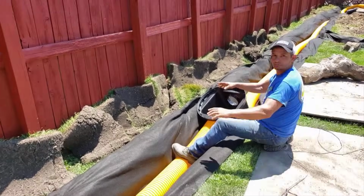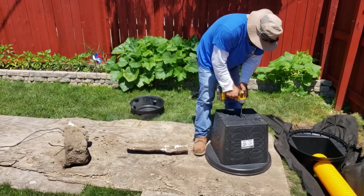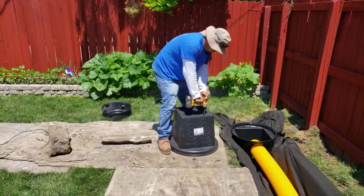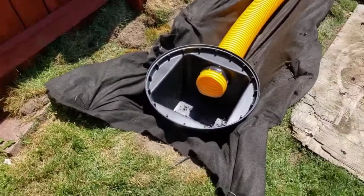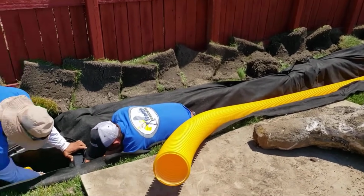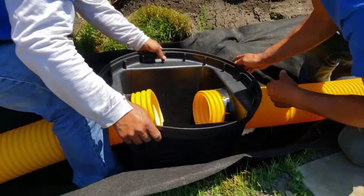Even clay has some percolation. That's why it turns to pudding. That's why when you walk in a yard that's flooded, it's soft and squishy. That's clay taking in water. So we don't want this to be a petri dish. There's 2 dogs and a very young child in this yard, and for their safety, we want these basins to dry up. So after a storm, there's going to be a lot of evaporation. We have holes drilled out through the bottoms of all of them.